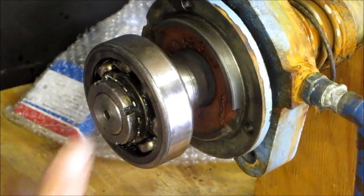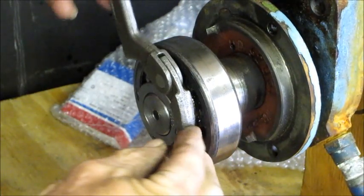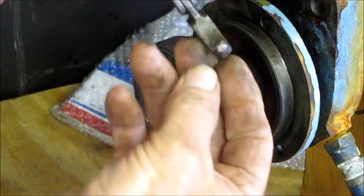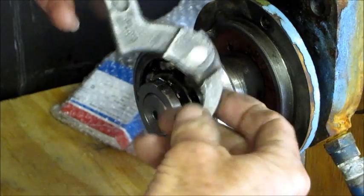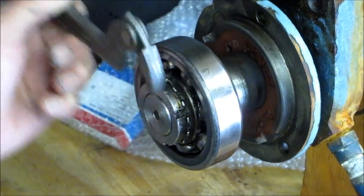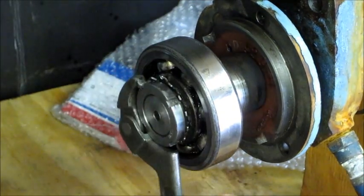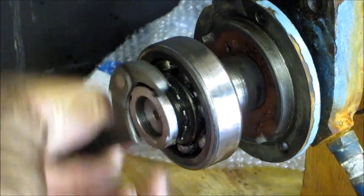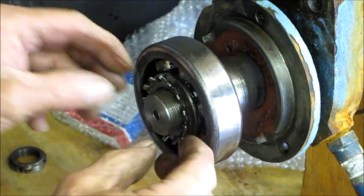All right, so now we need a spanner wrench to take that off. This is just a Williams spanner wrench. I've had this ever since the shipyards, and this is kind of a universal one. I've radiused it, because this is a slot application here, but sometimes you're slipping them into a hole that's in a sleeve. Alright, and we're just going to bring that loose. And we'll actually have to use it to turn it as well. Alright, and we'll put those in order.